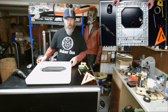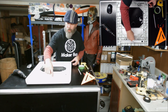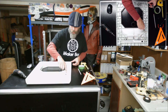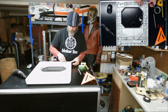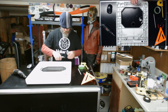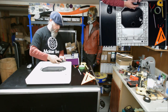If you can see here, there is actually a path you can follow from back by the power supply, through here — it zigzags under and through, and comes all the way along through here, and makes it almost all the way to where the power switch is going to go. It's going to break out one spot here so we can finish feeding the wires through. It usually comes out a little cleaner if you go ahead and score it with the cutting wheel first.